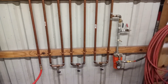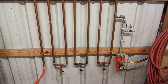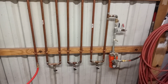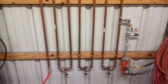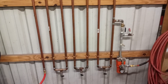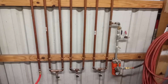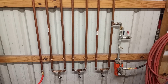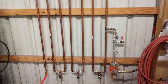I haven't had the opportunity to paint anything yet, but I've been messing around with it and it seems to be clean, dry air. Hopefully we get some better results. I mean, the results I was getting before were more than presentable, but I really want to go for perfection. Anybody considering doing a copper setup — it was really easy. You just have to figure out the fittings you need. They sell basically everything at Lowe's or Home Depot. I had to buy a torch, solder, and flux.